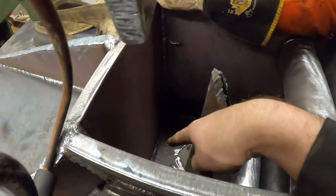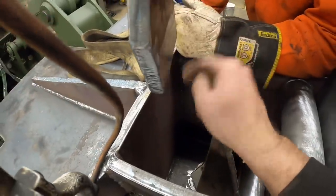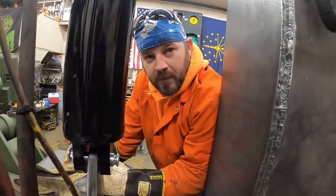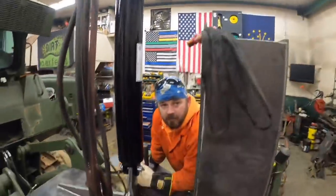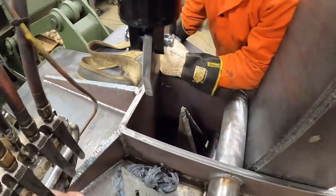We're gonna cut a slot in that bottom piece down there. Let this tab go down through it. That way you can get a full weld on the bottom. So we don't have to worry about that. And then we'll figure out the brackets on the top, but I got a feeling we're gonna have some pretty tight clearances. You ready? Yep.